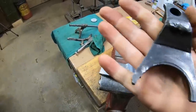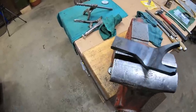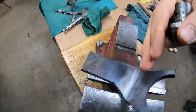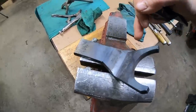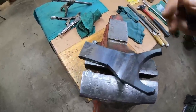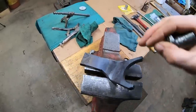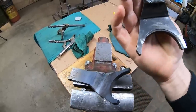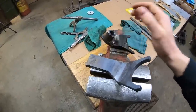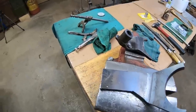If you're wondering how I was able to know where to place that under the V-block after just having a Sharpie marker line on there — what I do is I actually scribe the face of the metal a little bit so that after it's red hot I can still see those marks. That's how we keep everything in proper alignment. I think the first one turned out well — let's see if we can do it again.